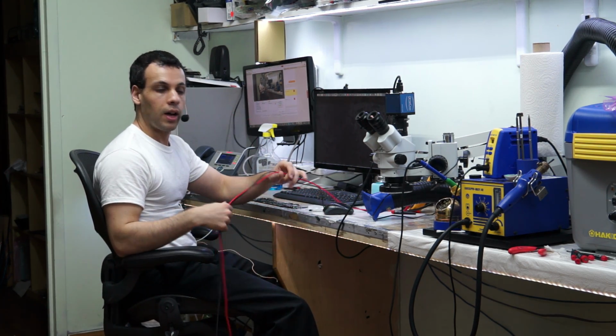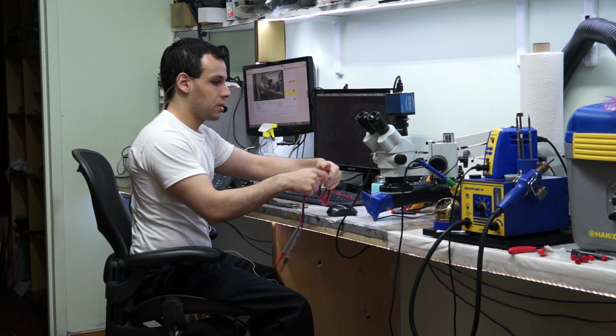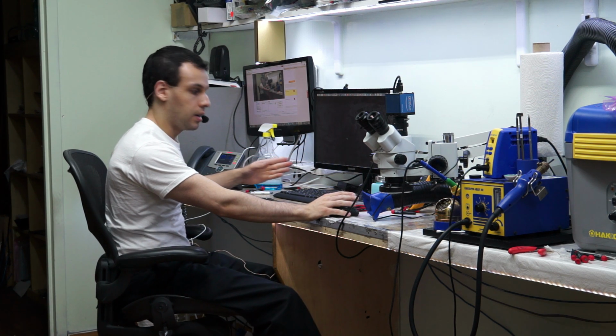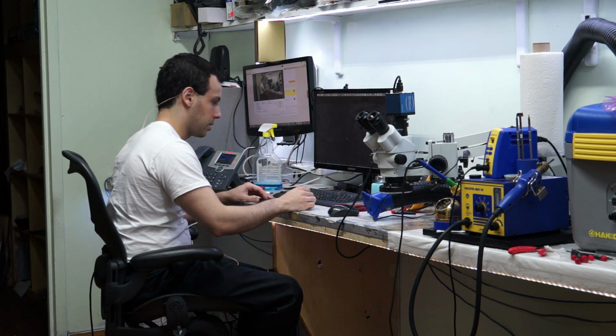So all of the Core i5 and Core i7 series MacBooks, anybody who has plugged in more than 2 or 3 of these knows that all the Core i5 and i7 series, besides on occasion the 2010 A1286, will just turn itself on automatically. So if it doesn't turn itself on automatically, if it doesn't enter that S0 state automatically, you can assume that something is wrong.